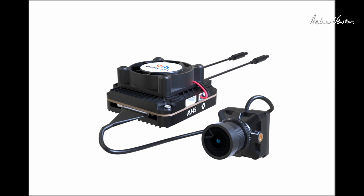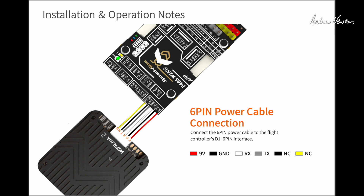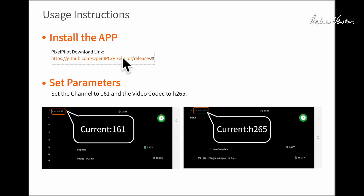Looking at the manual: M2 screws go into the bottom, 25.5 millimeters apart, so I've designed a 3D-printed mount available on Thingiverse — check the description for access. Being RunCam, it's compatible directly with the SpeedyBee flight control board. A cable connects from the video transmitter to the FC — there are six wires but the two end ones used for DJI ground and S.Bus are not connected — so we've just got voltage, ground, receive, and transmit.